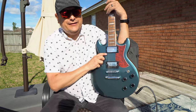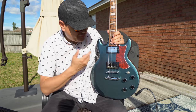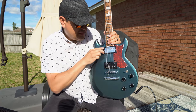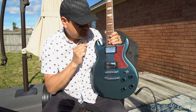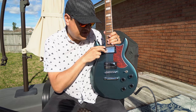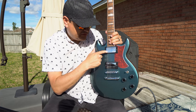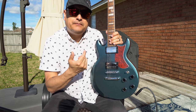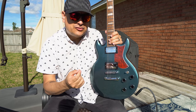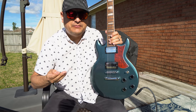So we came up with our own solution to that, and we call it the center punch humbucker. The reason we call it that is because the result is a really nice smooth mid-range that really works. What we end up with is about a 10k humbucker pickup. One of the coils is wound differently than the other. We use two different wire types on each coil, so that when we coil split this, basically the slug side stays on and it ends up sounding a lot more like a single coil. As a result of that, it also does not volume drop when you do that. Solves both problems, in my opinion. Let me show you.